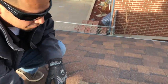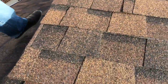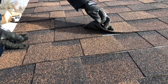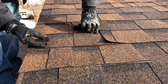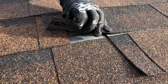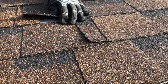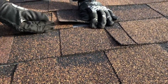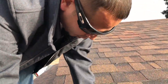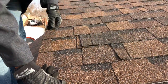If you record from here looking up, I'll show you two other areas where it's done the same way. Look right here — same thing. And look right here — same thing again. That is an improper way to install shingles; it's basically the lazy way. I don't understand it because the shingle was already cut — all you had to do is trim it a little more. Literally a couple of seconds with a knife, you could cut that really quick. They just refused to do that. So it's never going to seal down flat completely.